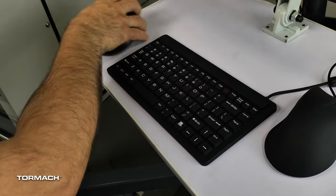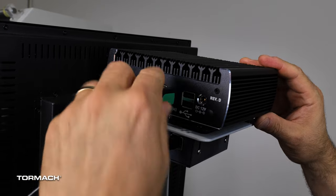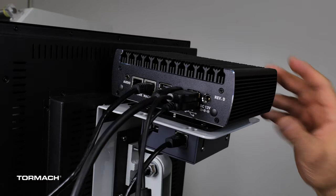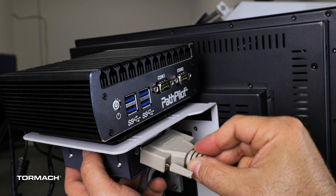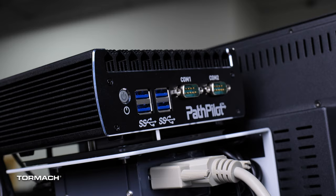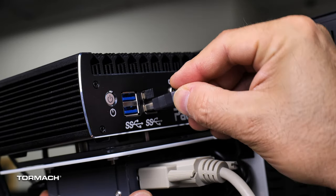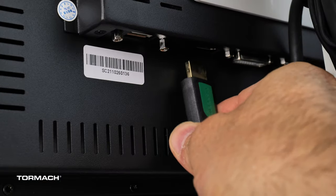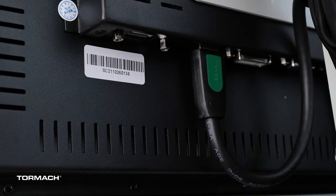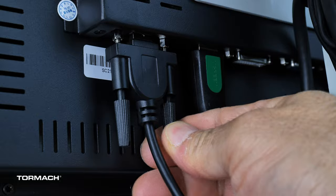Place the keyboard tray, mouse, and shuttle controller on the tray and run the cables toward the controller. Start connecting the HDMI cable, the USB cables, and the power cord to the PathPilot controller. Then secure the DB25 cable to the ethernet adapter, and the Wi-Fi receiver and the other USB cable to the controller. On the back of the monitor, connect the power cord, then the HDMI cable, and the touchscreen USB cable. Make sure to secure this with the finger screws.